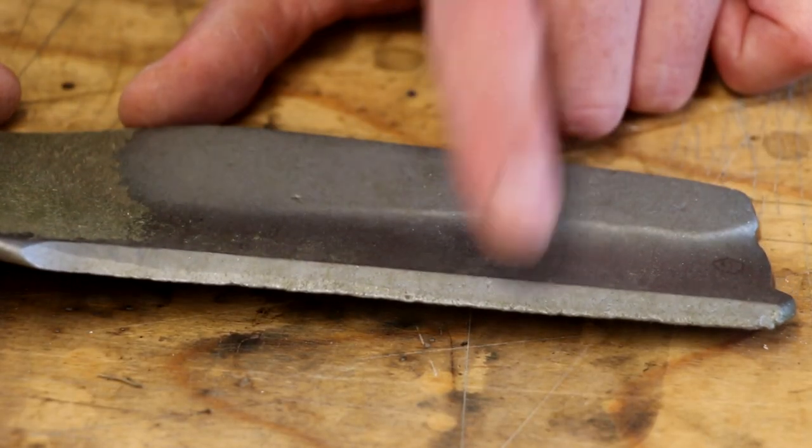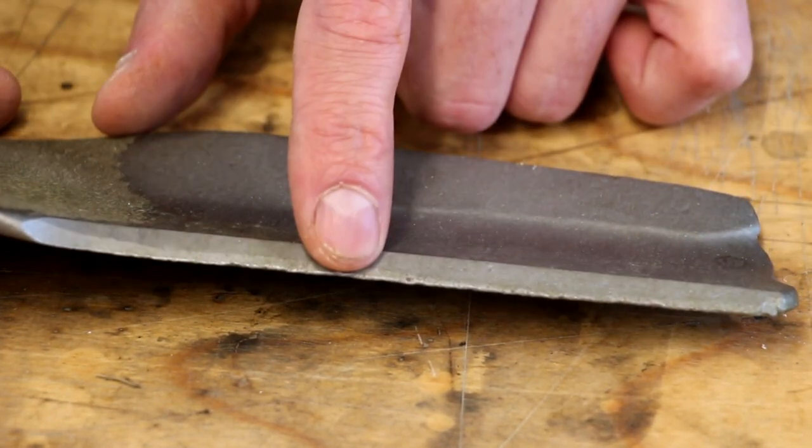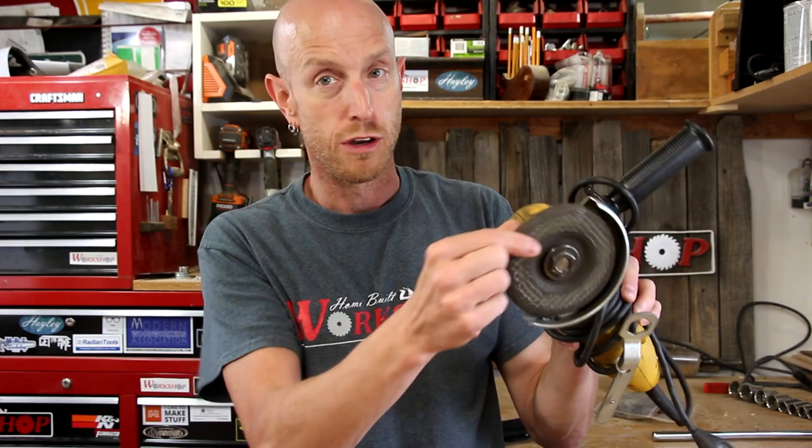This area right here is what we're going to concentrate on — we need to clean this up, get rid of all these chips, and put a nice edge on it. There are a lot of methods you could use to sharpen your blade, and none of them is more right or wrong than another. You could use a regular file, an angle grinder with a grinding disc, a belt grinder, or even stones that you chuck in your cordless drill to grind that bevel. It doesn't matter which one you choose as long as you can safely get a nice bevel on there.